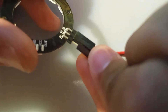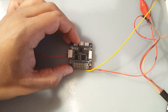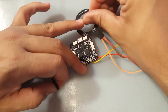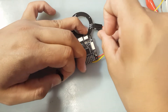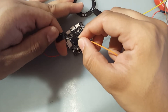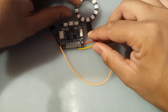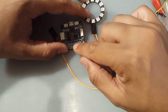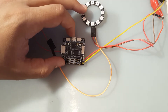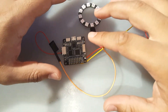The orange wire is the IN port. Now let's take a look at how to connect it to the flight controller. We have pin number seven and the orange wire is the IN, so that connects right there - that's pin number seven on the flight controller. Now we plug it in. In theory we've completely connected the LED. Just pretend I've soldered the power and negative on the rail - I'm running off a power bench which is exactly the same thing, so you would solder them right there and you should be fine. If we turn it on now, nothing will happen...